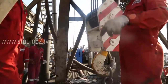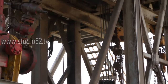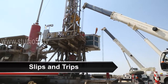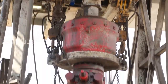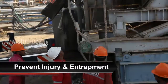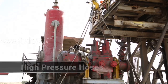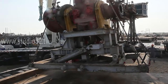Making up flange connections involves many of the same safety principles you would apply to any load — be sure to observe them. Be wary of other hazards associated with handling BOP. For example, slips and trips occur as the result of bad housekeeping, so keep house. BOPs are made up of separate sections, so use caution — keep hands, fingers and your body clear of moving parts to prevent injury and entrapment. Watch out for entanglement, electrocution and high pressure hoses. Be cognizant of limited workspace, the hazards of working from heights, and hazards related to the movement of loads.